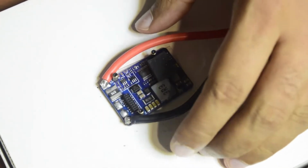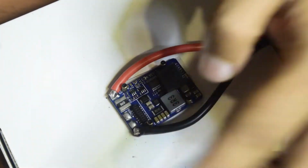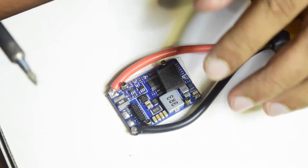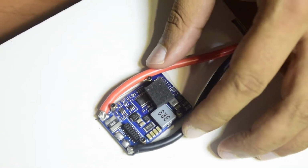So the wires get really hot, guys, so ensure that you hold it in place till it is all solid, otherwise it will move and it will be difficult to solder again. So here you see, guys, both my battery plus and battery minus are now soldered properly onto my ESC